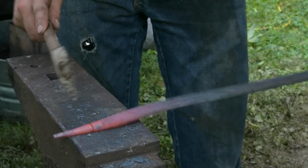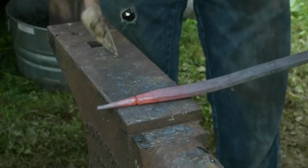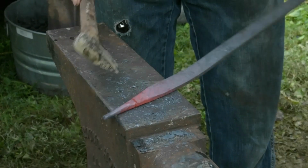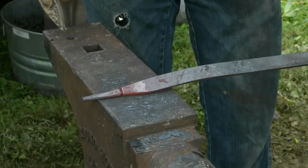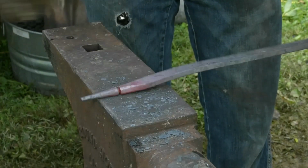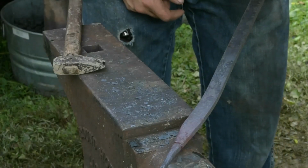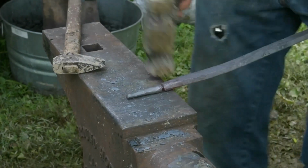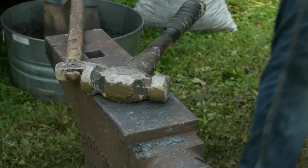One lighter, then a 90, then a 45. So if you look at the bottom of that hole, we created a square. Now we'll attack the corners of that square. So I went from 45, lighter. And now you can see I've got that cut right into center. Cutting that into center and making sure that your rivet itself is straight are two really important parts of it.